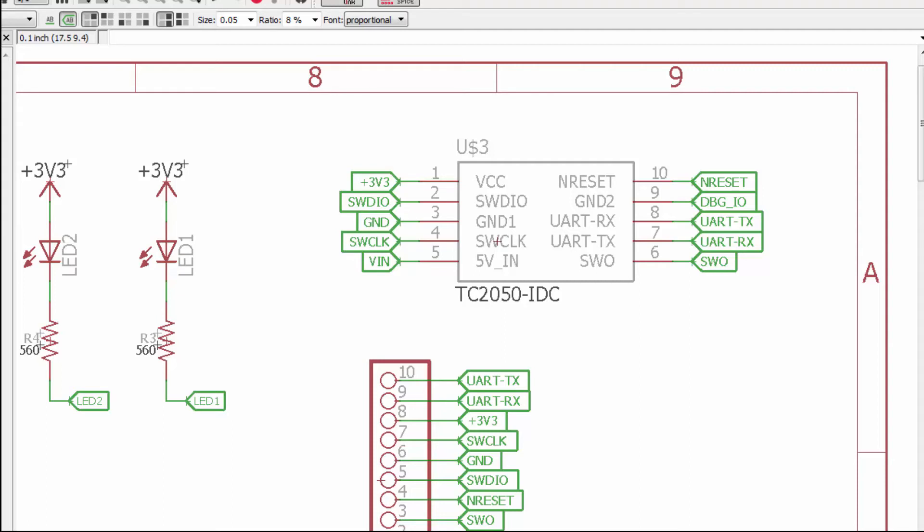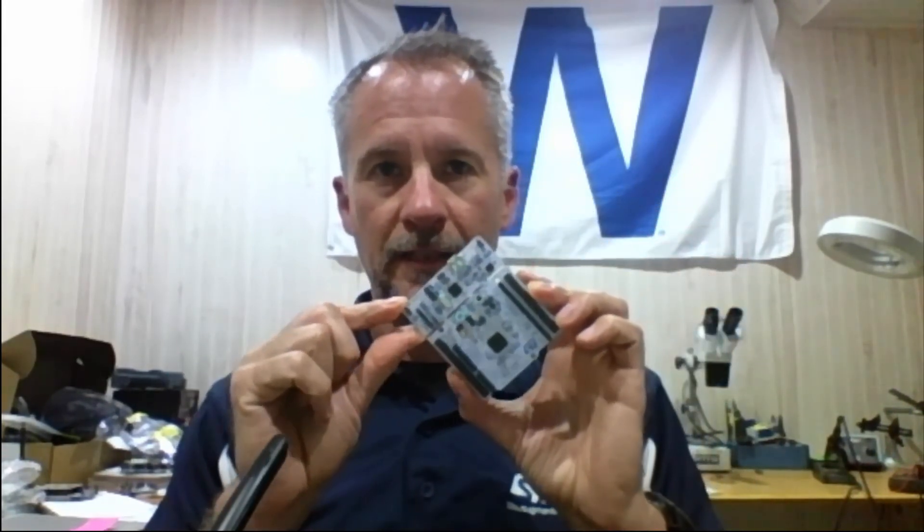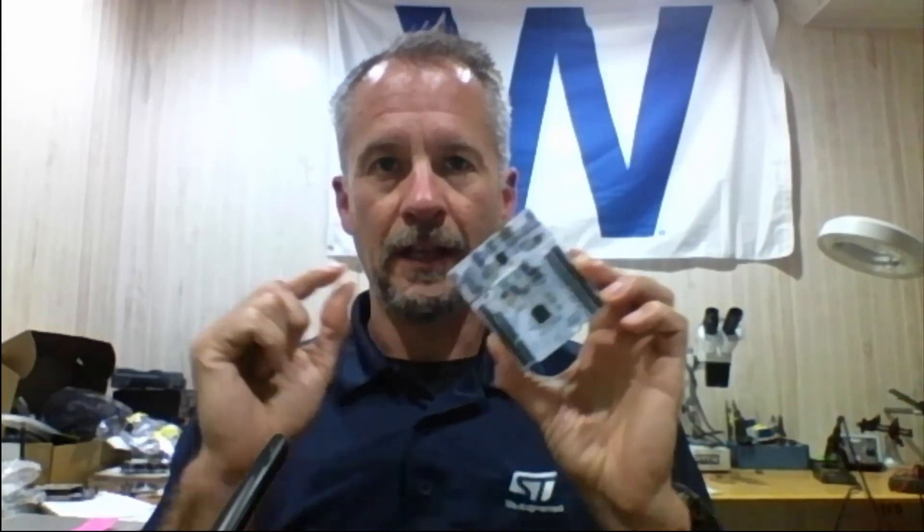I'll also show you how I used a Nucleo ST-link to build a super debugger for this application. In addition to the standard ST-link, the Nucleo board also has a snappable ST-link debugger on the top that you can break off and use in your own target application. It also includes a virtual COM port, so you can take the 1x6 header, connect to your debug connection via serial wire, and connect the CN3 pins to a UART on your target and do printf-style debugging. It's very cool.